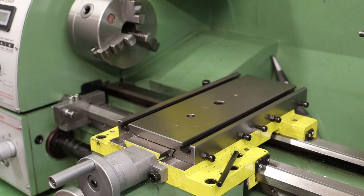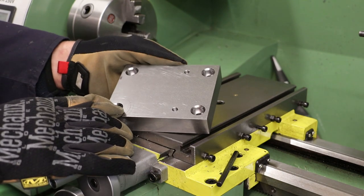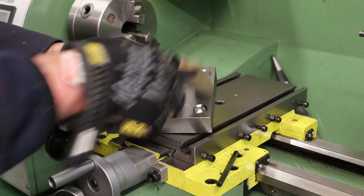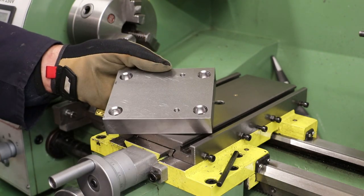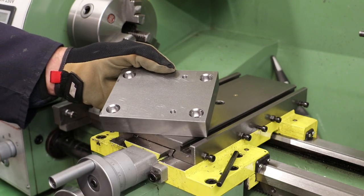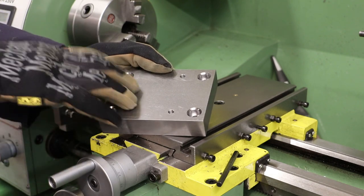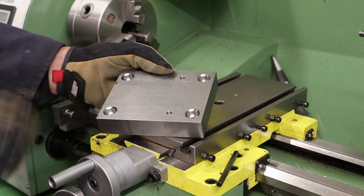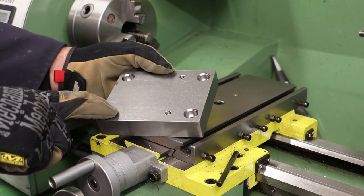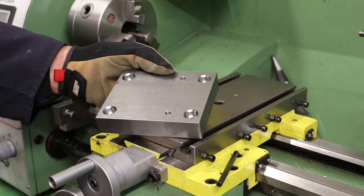All the parts have now been machined, so we're good to go — let's give it a trial run and see how it comes together. We'll start with the lower plate. As you can see, I have now counter-bored all four bolt holes. I did say at the beginning that I was a bit restricted with bolts, but I've now had my allen cap bolts. These two of course are covered over by the top plate, so it doesn't really matter — I've counter-bored them anyway to future-proof this base plate so I may be able to use it for some other purpose going forwards.